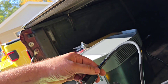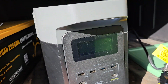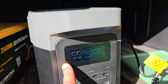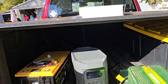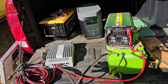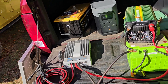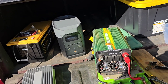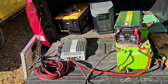The battery is at 13.9 volts and we're putting out 12.2 volts. I'm going to plug something in to demonstrate — this device is fully charged so it's not drawing much right now. You can run a table saw off this. You have to have the battery because it works like a capacitor — the charge controller can't regulate on the fly. You couldn't hook a table saw or the inverter straight to the panel output; you'd probably fry something. But with the battery in the system, you're making usable power.